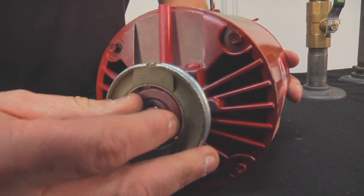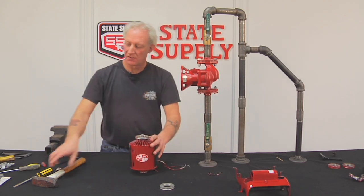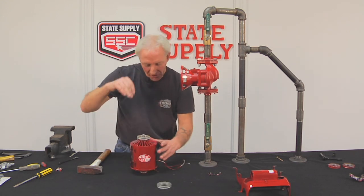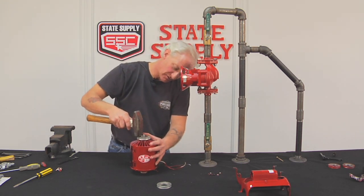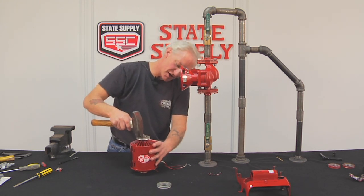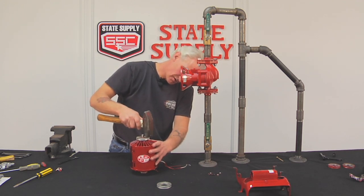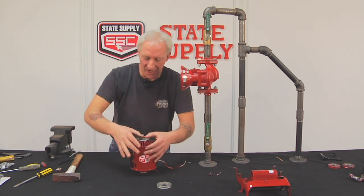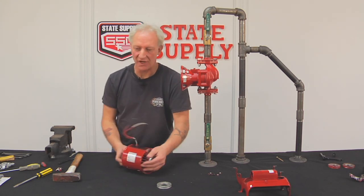We'll put them on by hand right now, then I'm going to grab my hammer. I'm going to tip it up and, equally around that inner ring, tap it going in a circle until it's flush on the end bell of that motor. Sometimes they'll fall off on you, so just take your time and try not to hit the shaft. When that inner ring is flush with the end bell, that's all the farther you need to put it on. Then we'll go and do the outboard side the same way.